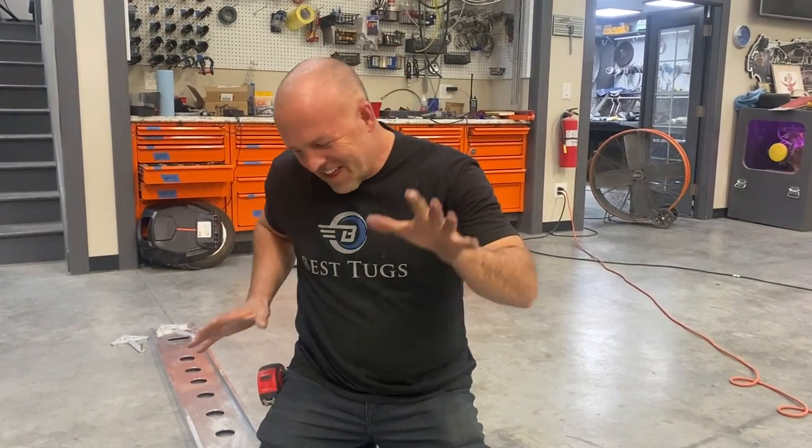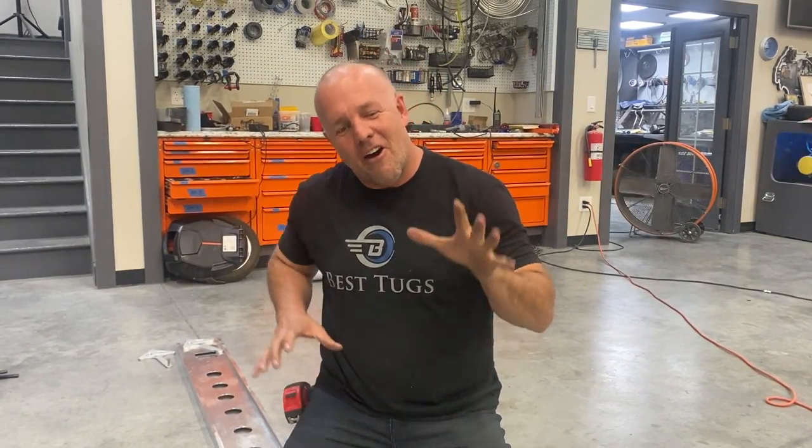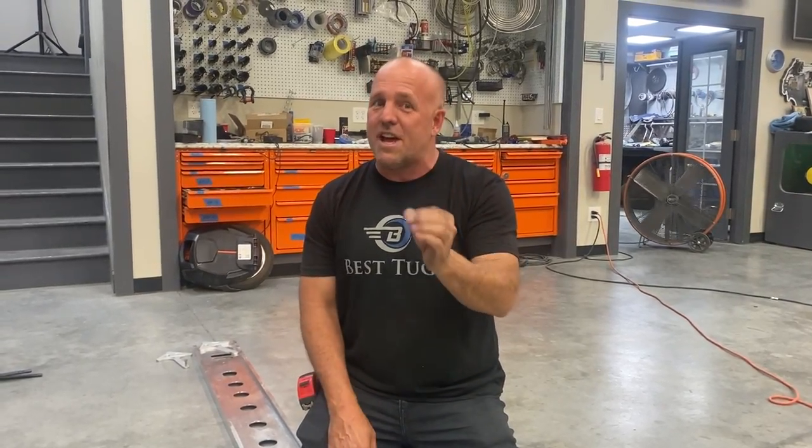All right, guys, this is the third spar of three, two for the airplane, one to bend and break. Now, I already have a really good idea of what this is gonna turn out like because the numbers between SOLIDWORKS FEA, which is finite element analysis, and what our test structural failure in the previous video did, was so close, it was within a percent or two.